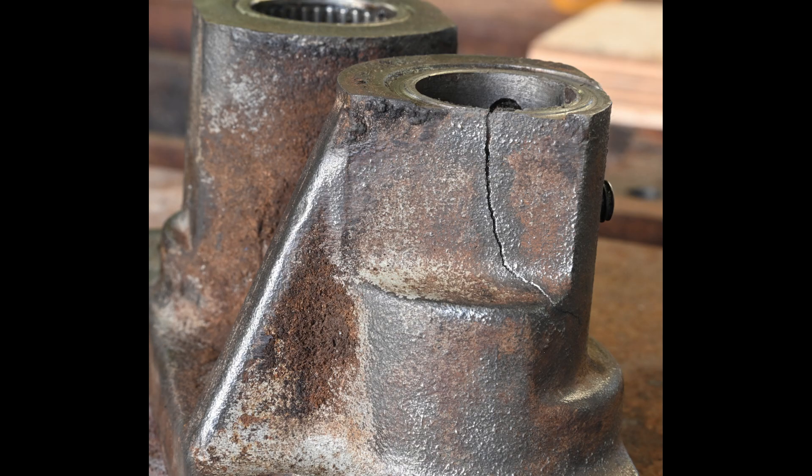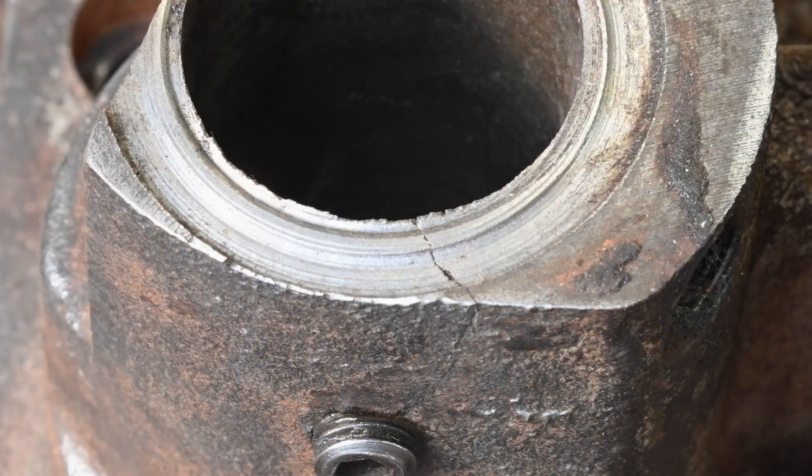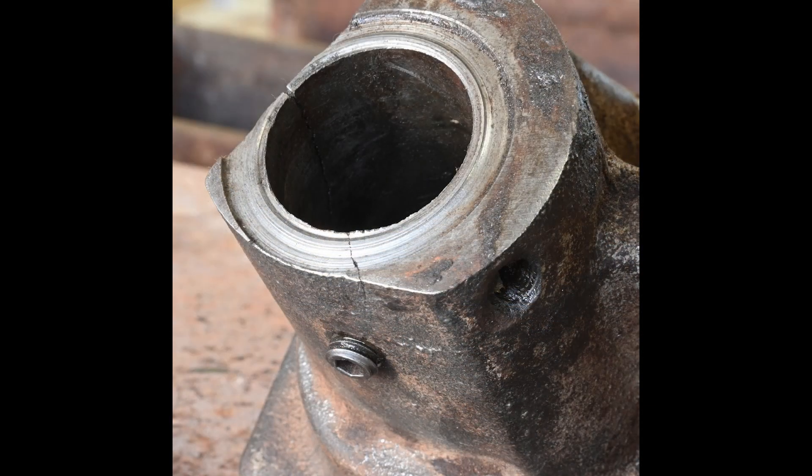The main options were brazing, nickel welding, and cold repair. One guy said I should just make it new out of a solid block of steel. I didn't want anyone to weld on this because there's no back-out plan with welding cast iron. The cold repair option came from a very capable, close friend of mine in aerospace, and it had very solid rationale.